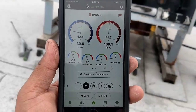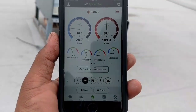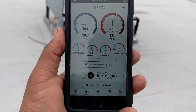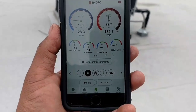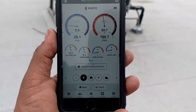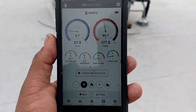We should be cutting the fans out at approximately 175 or so. Step one for me is to get this head pressure in order. Step two, I'm going to go in there and make sure everything is defrosted before I take off today. The fan cycling was cutting in too low, keeping my head pressure down.